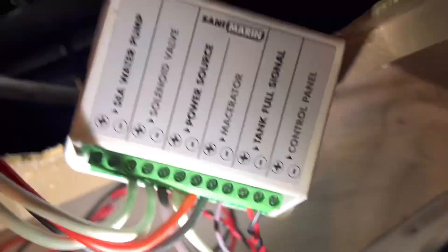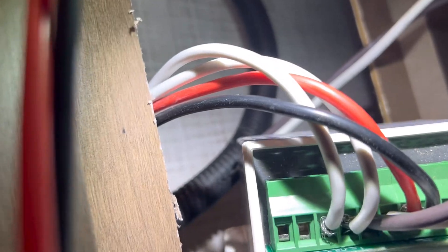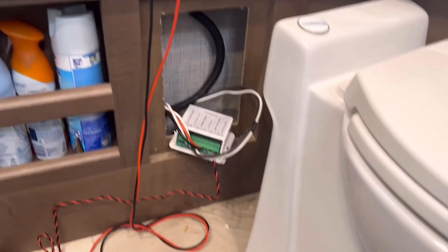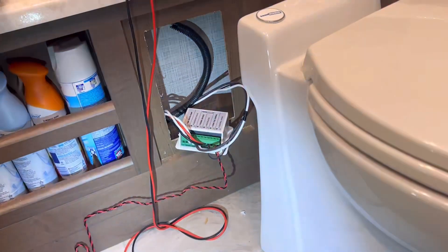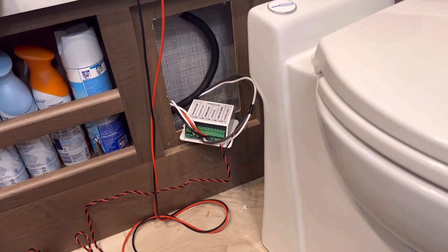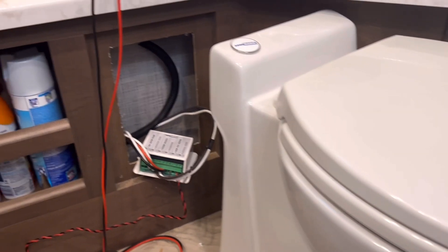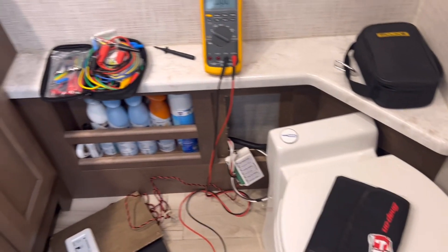This wiring is really messy and sloppy. I don't know if that's from the original manufacturer or from a previous technician, but there are a lot of frayed wires sticking out of this thing - and that is no good. I'll probably be taking all of those out and installing ferrules. In a situation like that you need a bootlace ferrule to take those stranded wires and make them into one solid connection so you don't have to worry about it.